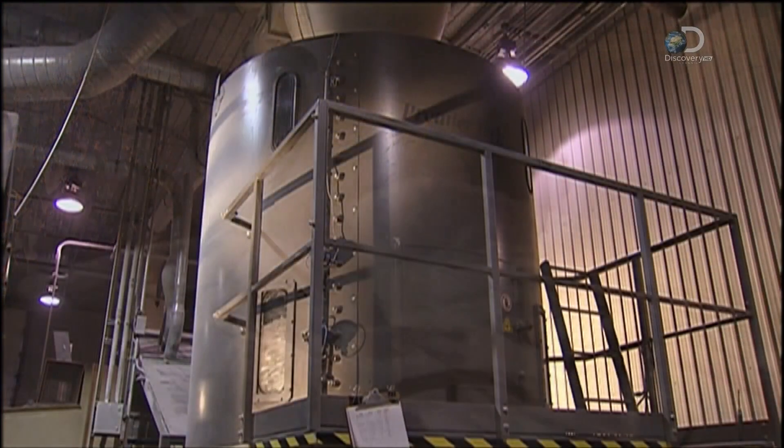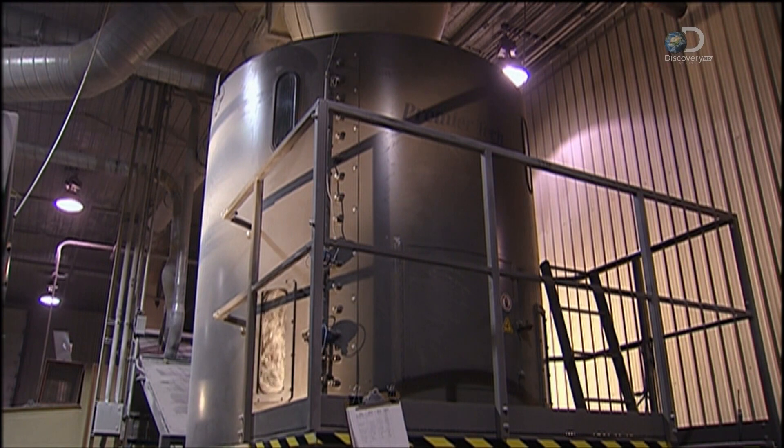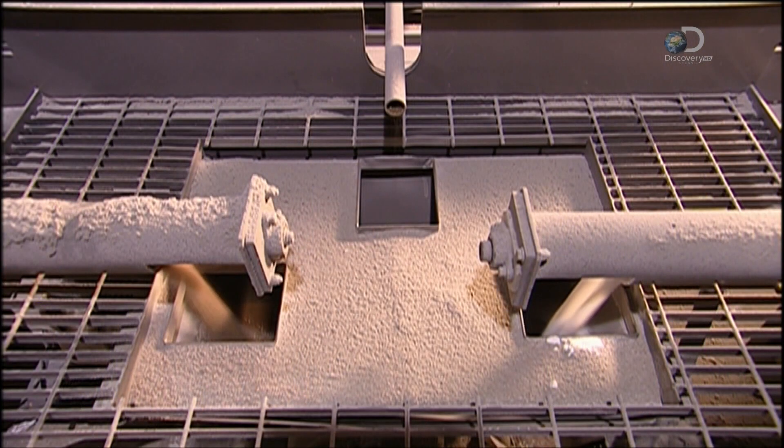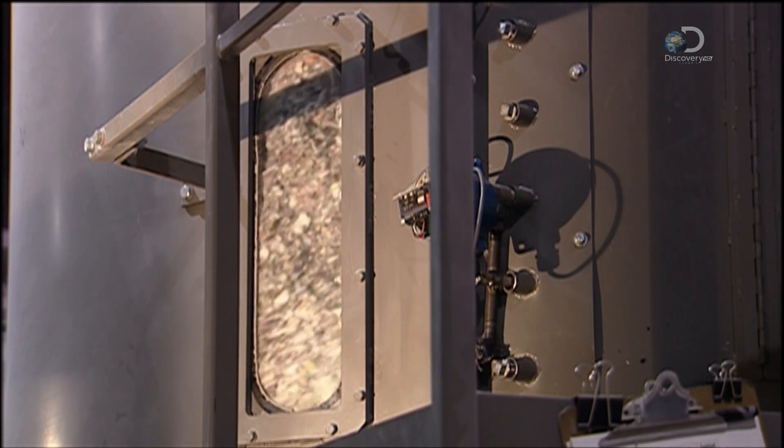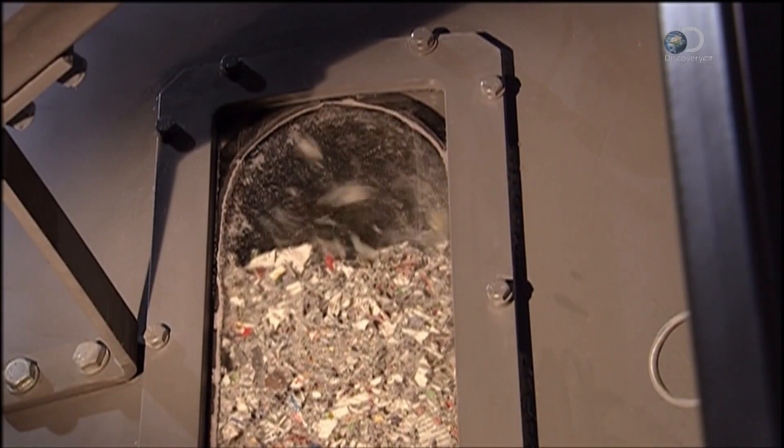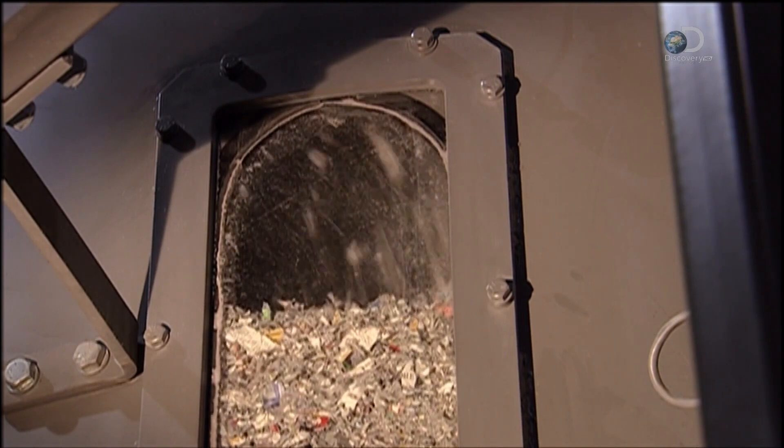From there, the paper goes into a shredder, which rips it into pieces about 5cm long. The shredded paper is mixed with boric acid, a natural compound that acts as a fire retardant. It also makes the insulation pest resistant, and it helps fend off mould, wood decay, and corrosion. A machine called a fiberizer then shreds the paper into tiny pieces about 4mm long, and mixes them with more boric acid.